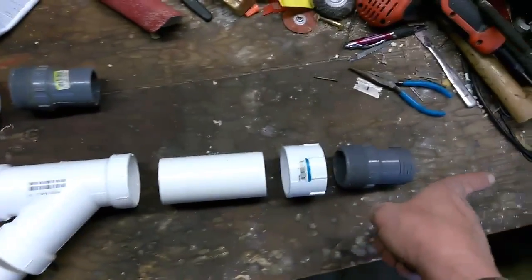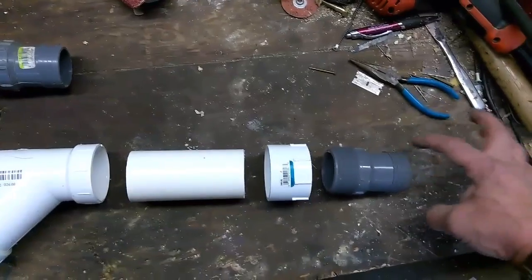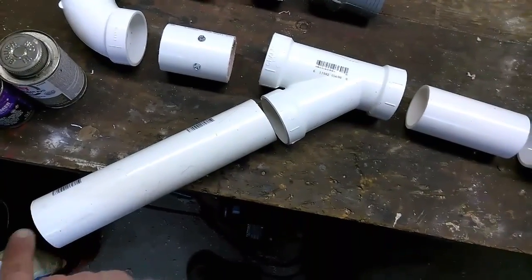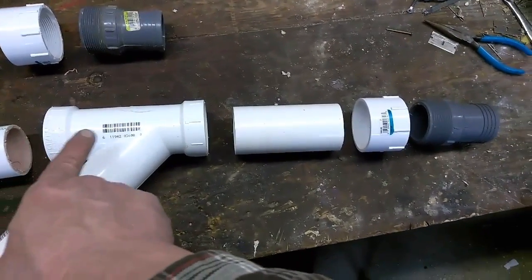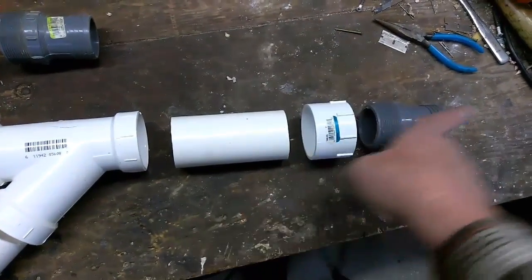This goes up to your sluice box, again with a 2-inch line connecting over here. This down here is where you'll be sucking up all the gravel, rocks, sand, and with a little luck, some gold. Goes up through here, the high pressure water shoots down through there, creating the vacuum, the suction, and off she goes.